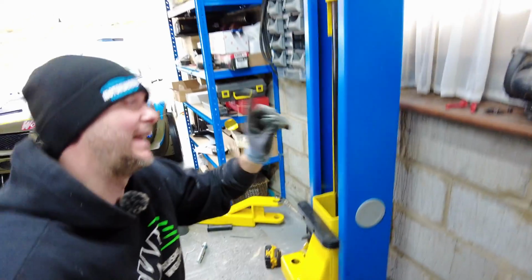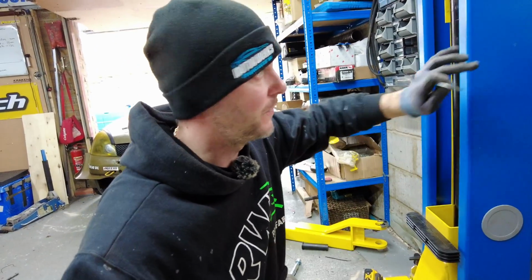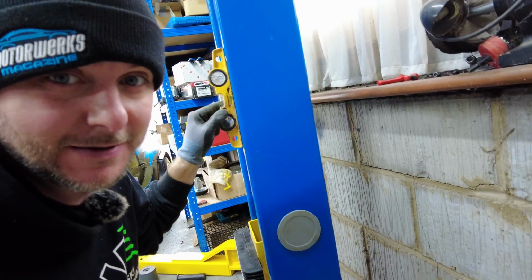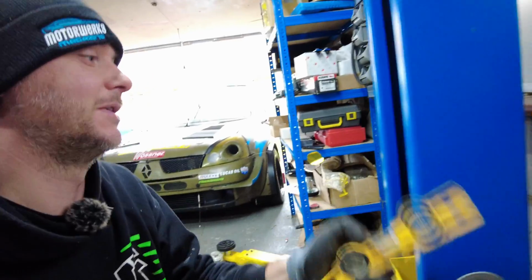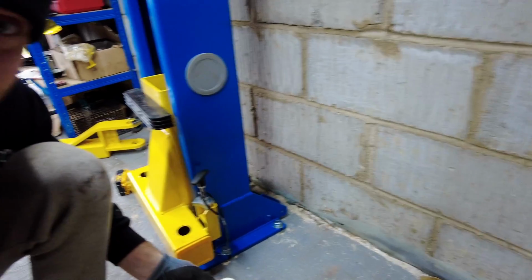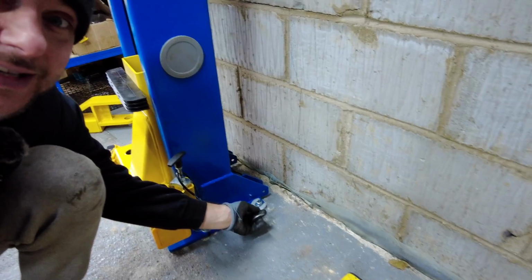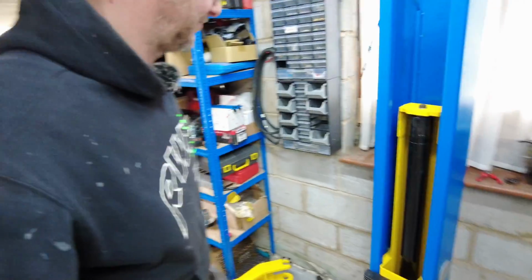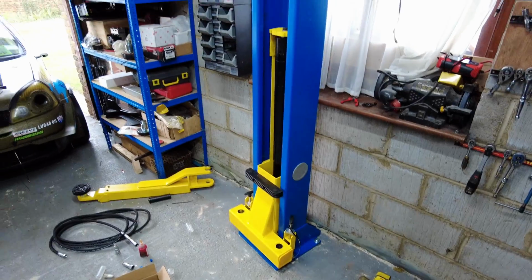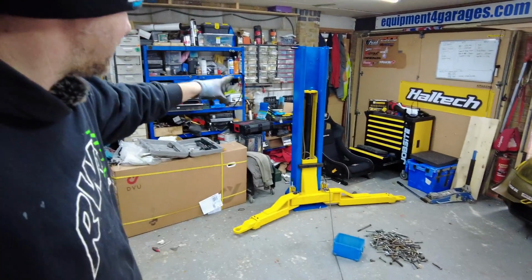You might want to level it, because if your floor is uneven, you want those posts to be absolutely spot on. If you can see, perfect. And if we look this way, perfect. How did I achieve that? Like this. They're little shims cut on one side that you can, right at the last minute of fitting, shim underneath and then you level it like this. So, very happy. This thing is attached. So now let's do the other side.